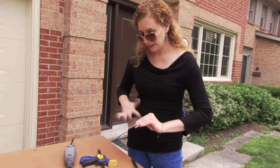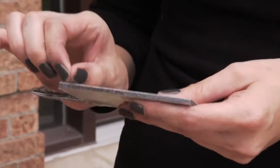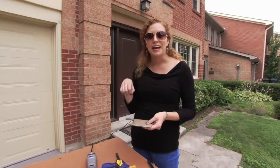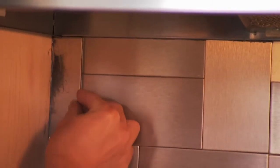When Rika was laying out for me where she needed me to cut, she also labeled the tile. The trick is that these tiles actually come with a plastic coating on them that protects them while you're cutting. This means that we'll be able to take that number off. It also means that I can have a stack of tiles that she's numbered for me, and when I take that stack in, we know exactly where each of them goes on the wall because we labeled the wall as well.